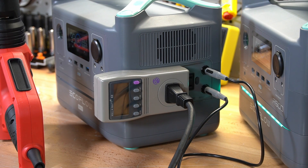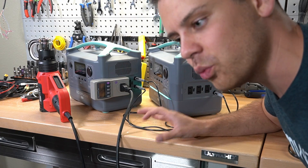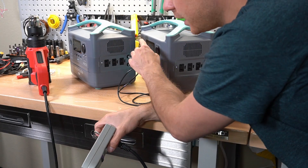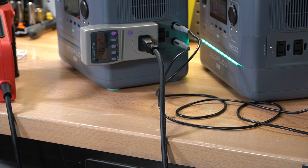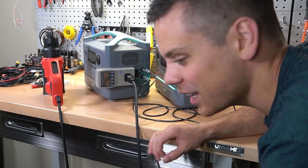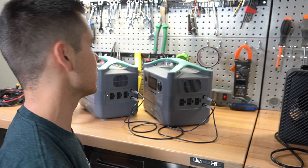I actually thought it was going to work this time. What a bummer — and they actually both shut down this time. In the previous test, only one would shut down, so this is slightly different. Now they're both running again with the symbols showing they're connected. We're only pulling 1,000 watts this time — let's see if it can run this load instead. And it failed again. Even though it failed the test, we're going to add the load and deplete the battery and see what the capacity is.